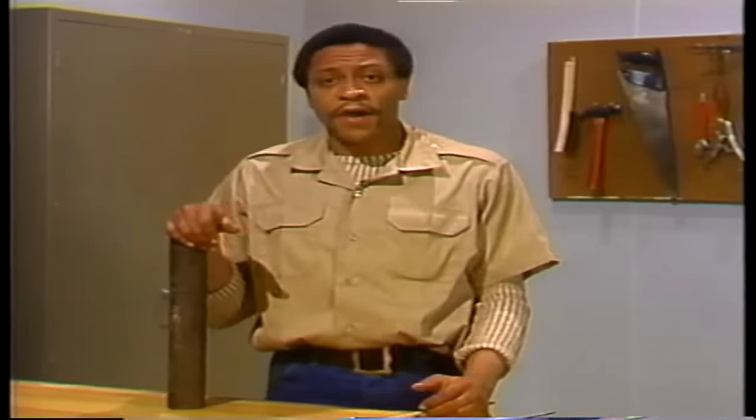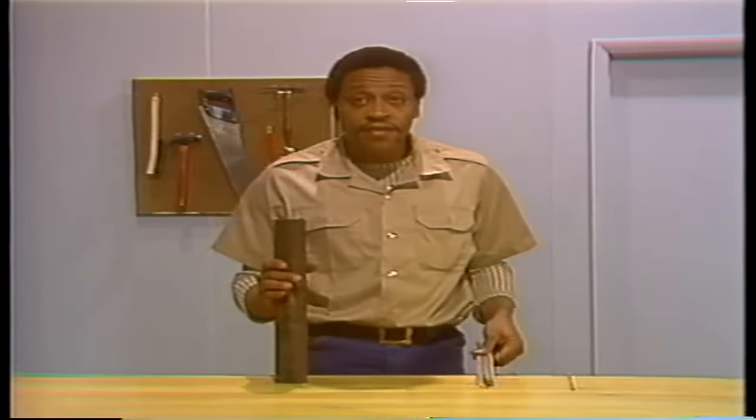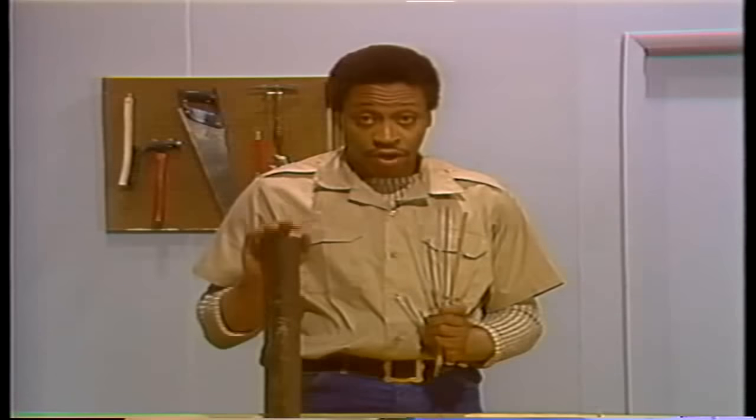When getting ready to assist in a repair, be sure you're thoroughly familiar with the procedure. If your plant has a written procedure, read it over carefully and be sure you understand it. If there are no written procedures, talk the process over with an experienced welder. Also, make sure that you know the materials, equipment, and working methods that apply specifically to your boiler. The type of metal that the tube to be repaired is made of and the type of weld rod used for the job are both important considerations. There are a lot of different kinds of weld rod available and a variety of metals used in boiler tubes. The type of tube metal and the type of weld rod must be compatible. If the wrong kind of rod is used, the weld made with it is very likely to fail. For this reason, the foreman or an experienced welder usually chooses the type of welding rod.